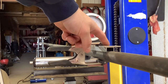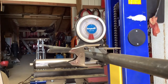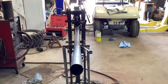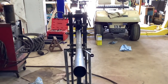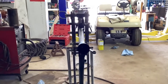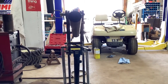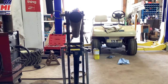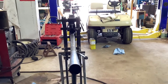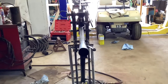As long as this clamped piece stays in line, I can recheck my zero and then eyeball my bend and it'll be perfectly aligned. I'm coming down the tube and making sure that the top of the tube looks exactly centered on the radius of the top of that die, just eyeballing everything to make sure I'm right in line the way it should be.